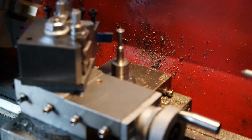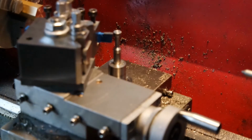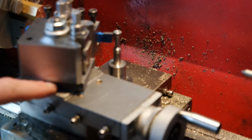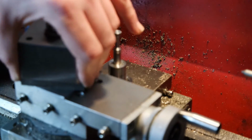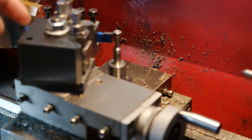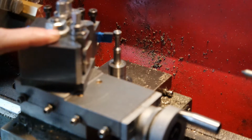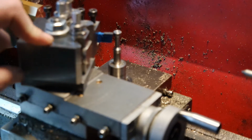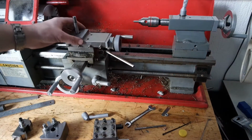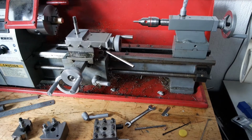cylindrical part is center height, and as you can see I still need to drop a few millimeters, and I just don't have the room for it, so I either need to make this spacer thinner, or turn an opening for the boss on this bolt in the block itself, but I don't really like that option, but maybe I have to. I won't address this problem now, I will just continue with the hexagons.